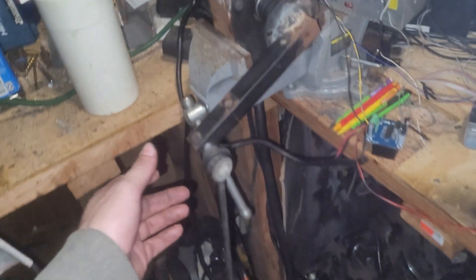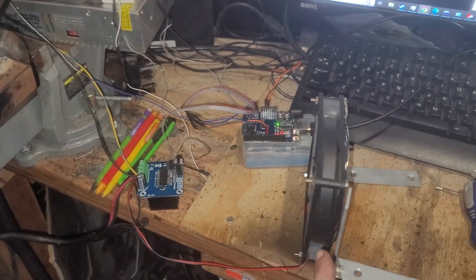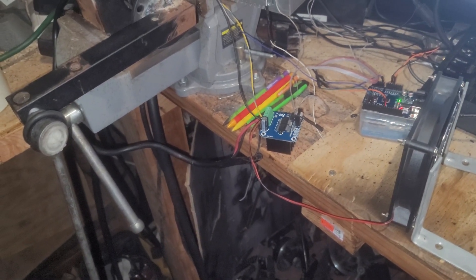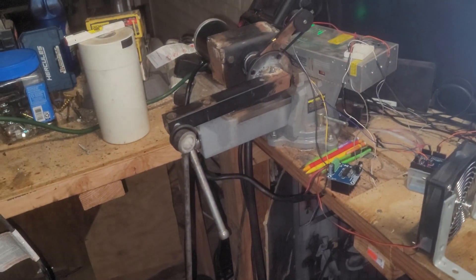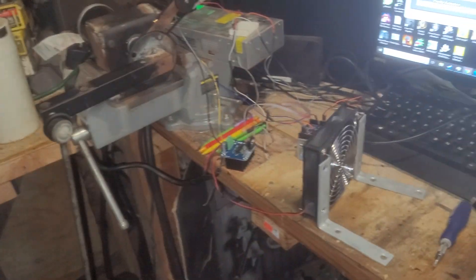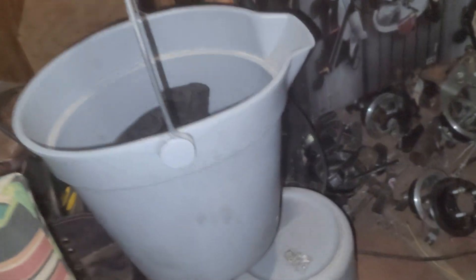It'll raise the arm — usually up to about 90 degrees — then I just let it sit there and hang. I also have active cooling on the IBT2: a 24 volt fan moving a decent amount of air, cooling the IBT2 as it holds. I've got a stopwatch and I time it. Once I power it on and the arm lifts up, I start the timer immediately and see how long it holds the weight until failure.